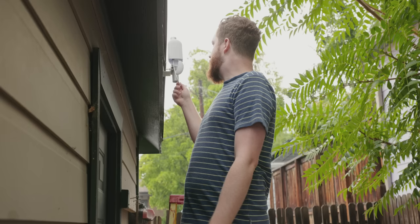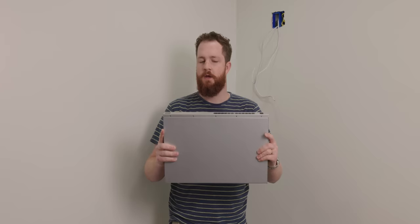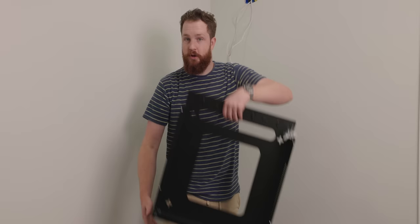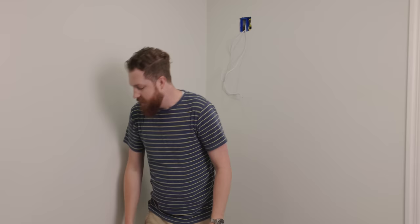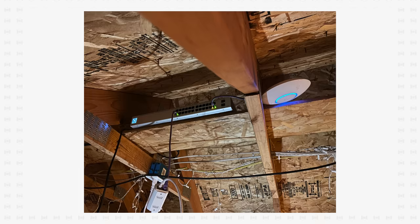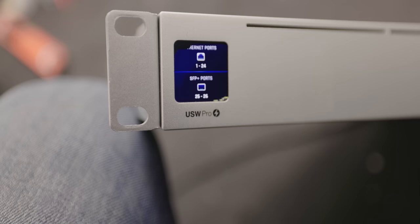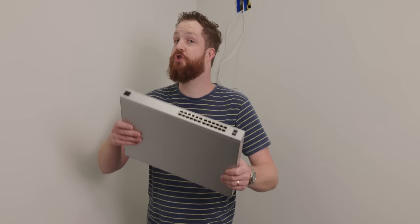They work really, really great. The problem is this one isn't really plugged into anything right now. I need to mount my switch on the wall and actually get Wi-Fi into the garage. Here I have my switch. For a piece of enterprise equipment, this is actually pretty attractive, but by the time I have a bunch of Ethernet cables and power coming out of it, it's going to be a little unsightly. So I bought this enclosure to put on the wall. This is the only insulated and climate-controlled room in the garage — the rest gets really hot in summer and cold in winter. This switch has been sitting for months in the attic above this room, where it's been north of 130 degrees, which is really bad for networking equipment. The LCD display has been almost entirely damaged just from heat exposure. So I have to put it in this room if I want it to last more than a year.